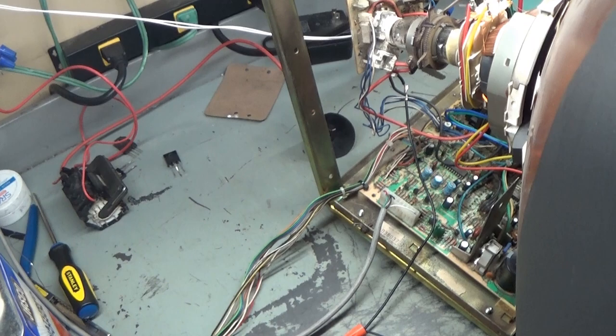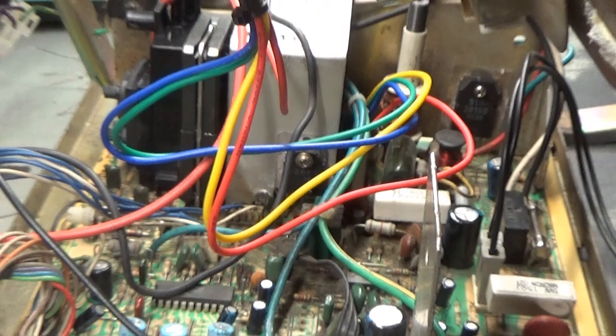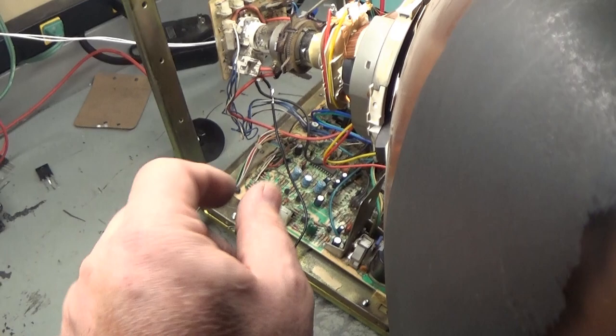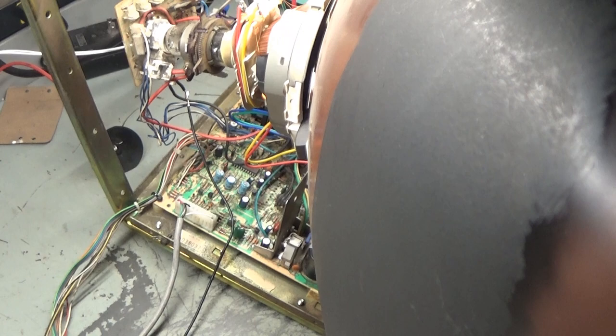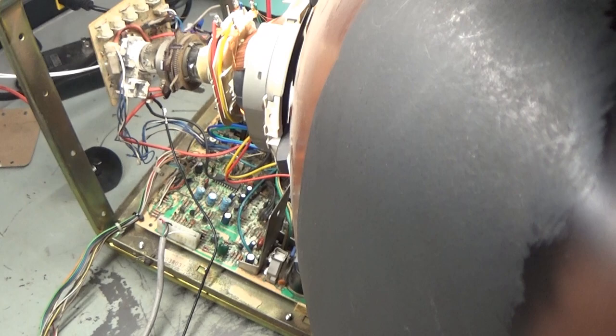So whatever was going on with this flyback was causing a short on the HOT. I think it might even have been shorted to the frame. I can't say. But with another HOT, I put a brand new 3686 in there. Again, these are the ones that are meant for the 74, 75, 2000, 5000, but it is compatible with the 7000, as we're about to see. So I put another HOT in there, a new flyback, and the new flybacks come with the screen pot all the way down, so I turned it up about a quarter. I just turned it on long enough to make sure I got a picture. I haven't adjusted anything. So with the new flyback in there and the replacement HOT, check it out. Power's right up, normal noises, and there you go.